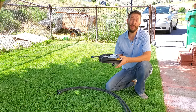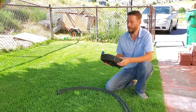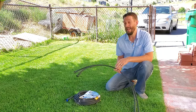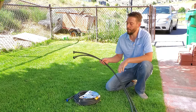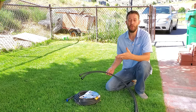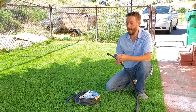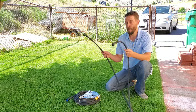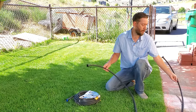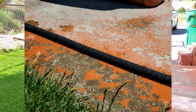Now that's also to say: don't have your pressure too high, but the other side is also kind of bad. If you're having low or poor water distribution out of your hose, it might even be because your flow has been reduced too much and the pressure is too low. That's another common problem. People try to reduce it to make sure everything is fine, but if it goes too low, where the water goes in is going to experience more internal pressure than the very end where it's capped, and you'll get more water coming out towards the head and less towards the foot. What I recommend is to literally lay the hose out on a sidewalk in a long straight length, get your pressure regulator set up, connect it to the water, turn it on, and watch the water flow on the sidewalk to see if it appears to be flowing evenly.